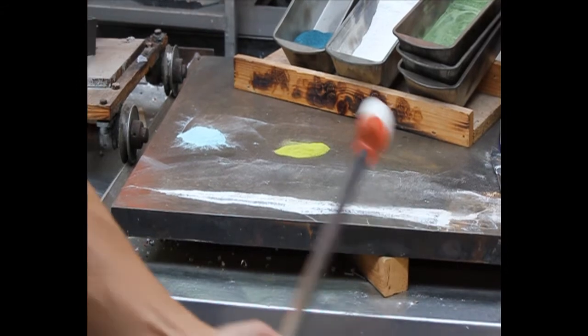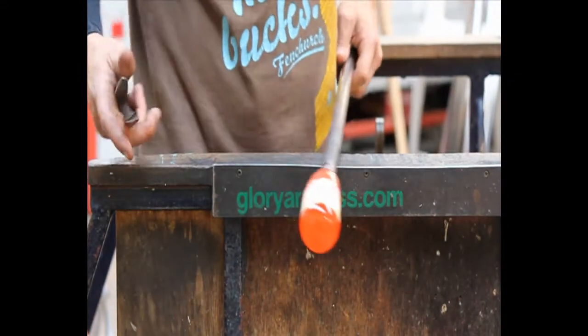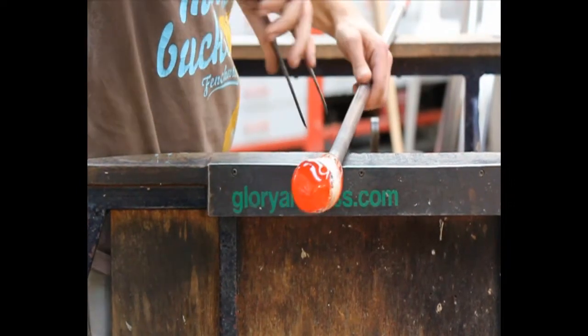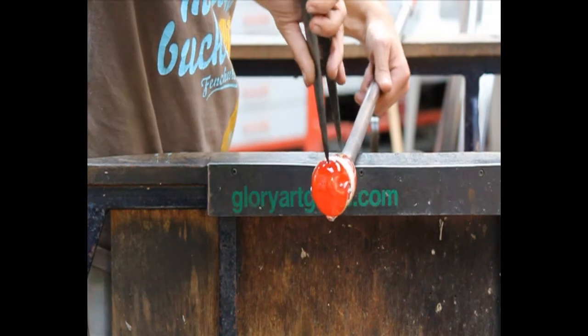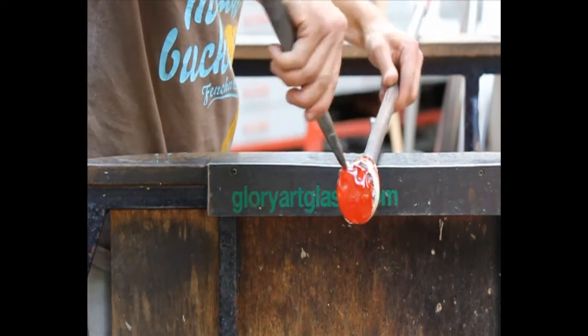Crystals of glass can also be used within the glass making process. These cause the glass to have bigger blotches of colour on the surface. Once the colours have been added, the hot glass is then returned into the furnace, or the glory hole. This melts the colours into the glass. The beautiful colours are now part of the piece.